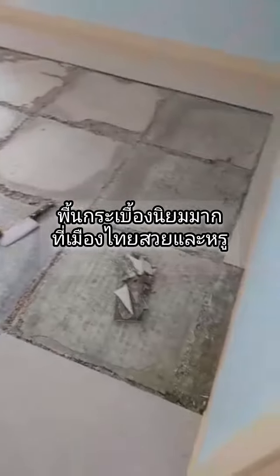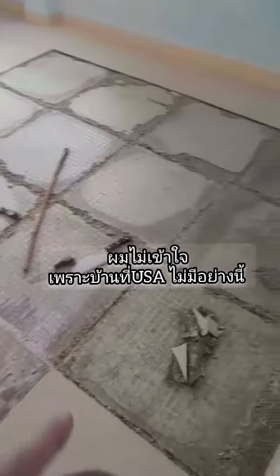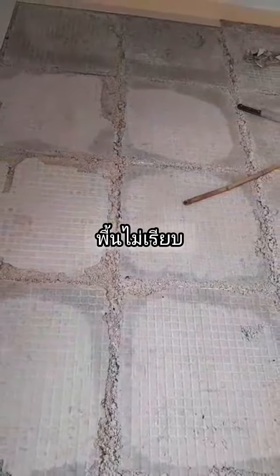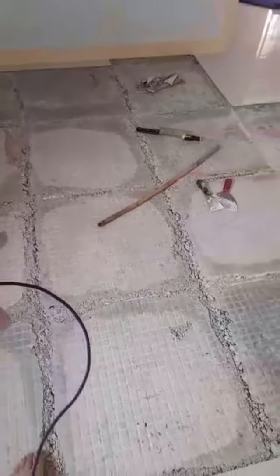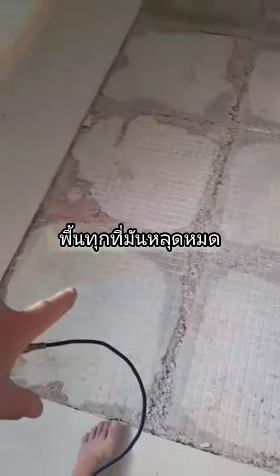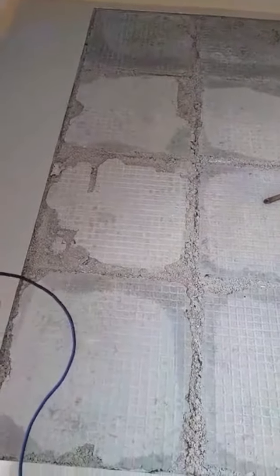You can see the bed that they laid for this thing is kind of a weird way of doing stuff — it's not a regular concrete pour. It isn't filled in completely; it's got gaps. Where if you step on an edge of a tile, it'll eventually become loose and start a seesaw action with your foot, which is what a lot of these tiles, especially in here, did. They all became loose, and you can see where this stuff broke away and they all became loose tiles.